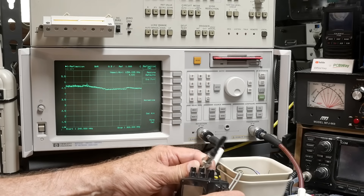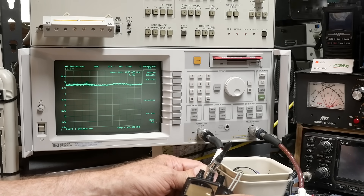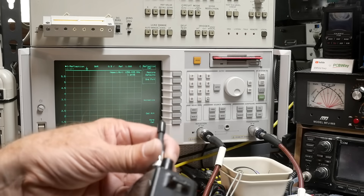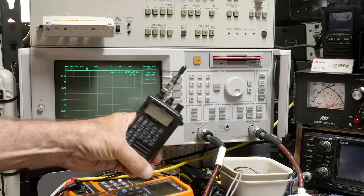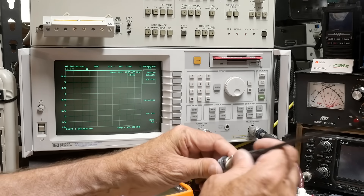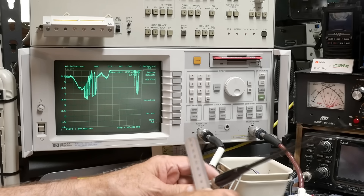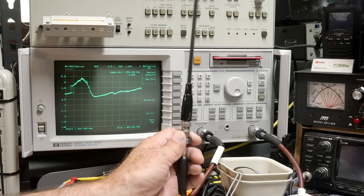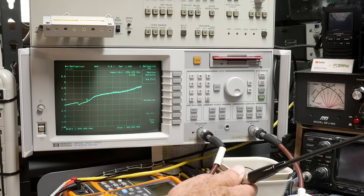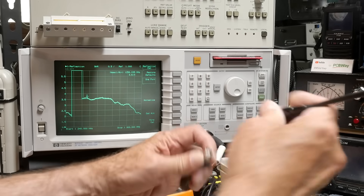Let me hold the radio onto it kind of like we're going to use it — maybe something like that. It's not the greatest antenna in the world. Now let's also try the ICOM antenna — look at that, it's almost as good. Adding a counterpoise didn't help. Three and a half to one SWR depending on where I'm pointing it and how I'm holding it or grabbing the coax. Maybe it would work in a pinch, but it's not designed for it.